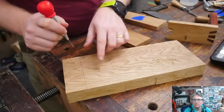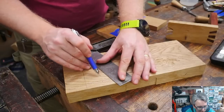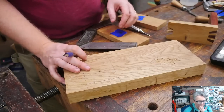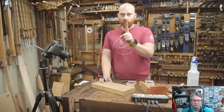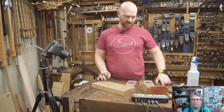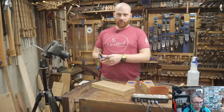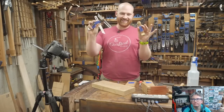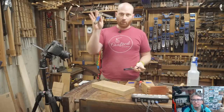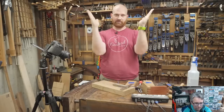So I've got a center mark there. What I want to do is draw rays out from that point — rays of the sun coming out from this point farther down. Next thing you're going to need is however many rays you want; you're going to need a bevel gauge for those rays. If you want three rays, you need three bevel gauges; four rays, four bevel gauges. I'm going to do this with three. I have them marked — number one are the rays closest to the middle, twos are the next one out, and threes are the farthest ones out.